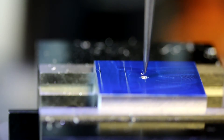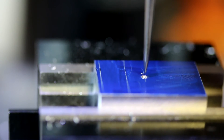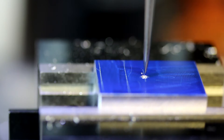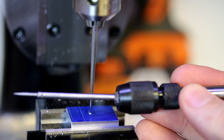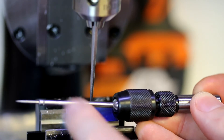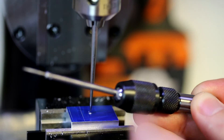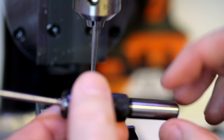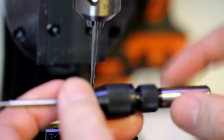In the previous video I mentioned using a scriber point, which was for our strap clamps where tolerances weren't really tight. The scriber point isn't our best option because it may be bent and may not set true in the drill chuck. So we want to use a different approach. The tool we're going to use is what's commonly known as a wiggler — a shaft with a ball end and a collet that holds the ball and allows it to move around. It's got a 3/8 inch shaft, so we'll need to use a 3/8 inch drill chuck.